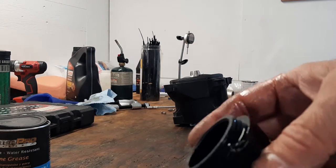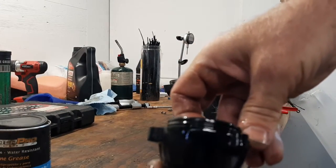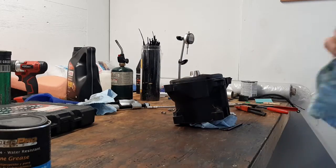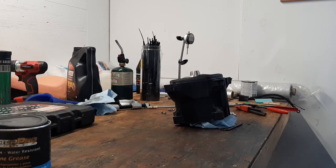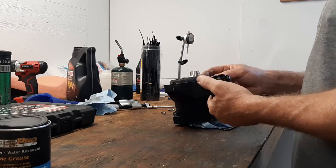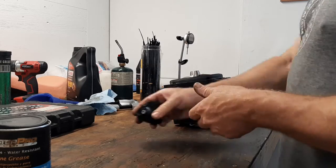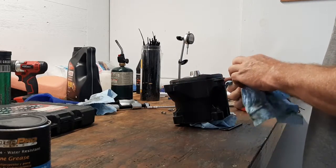There's an o-ring on this cone. They suggest you change it every year or every time the cone is off, but I usually just inspect it and make sure it looks good and fits in there tight. In the last 20 years I might have put one new o-ring in it. You'll know if the o-ring is going bad because you'll have some water in your oil.